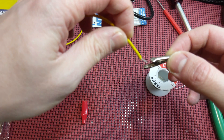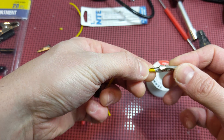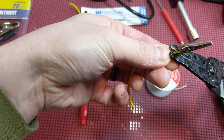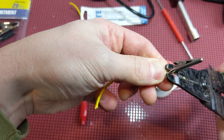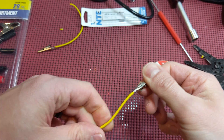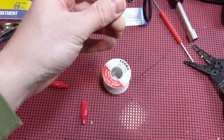First, put your wire through the hole like that and solder on the back side. See how we have a nice coverage here — when we crimp it, it wraps the wire nicely, just like that. Now we have a good surface to solder to. It does require a little extra heat, so turn up your soldering iron.